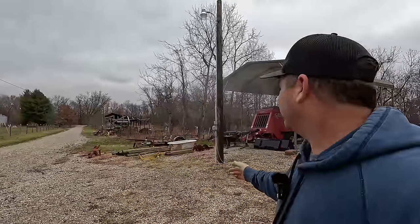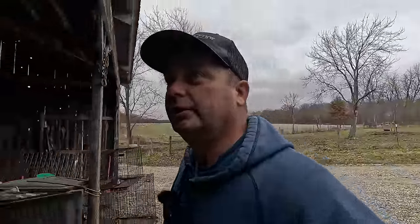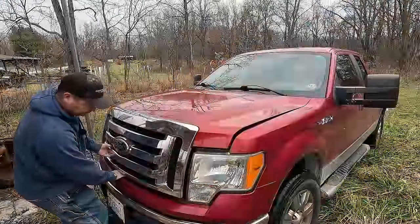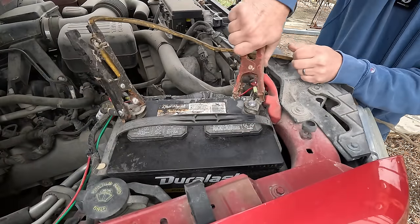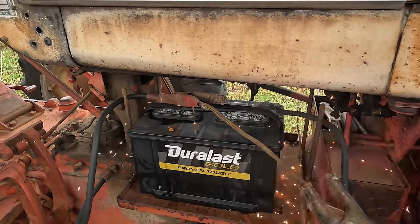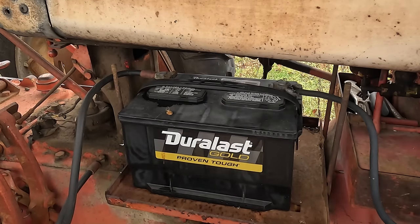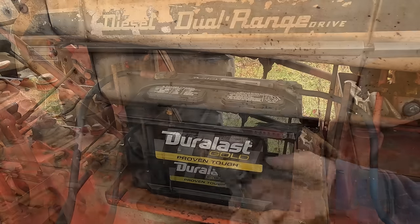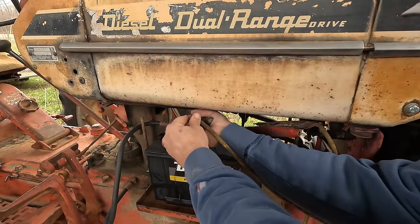I think the battery's just weak. Let's see if we can get it jump started with the truck. That diesel smokes like crazy — it's billowing out of the carport. I found some jumper cables in the livestock barn, covered with cobwebs. The cables were marked backwards — the red band was actually the ground going to the tractor — so I had to try again the correct way.